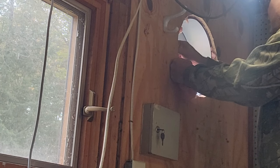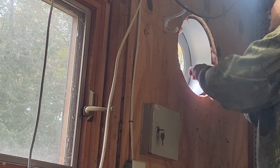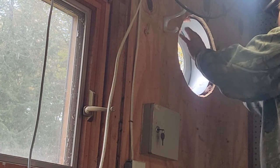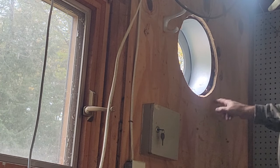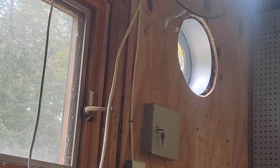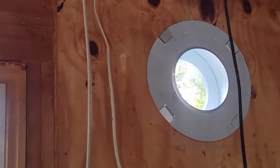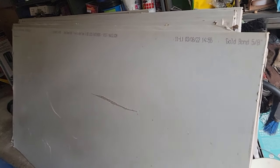The collar fits good on the inside — it looks great. I'm not going to fasten it yet because I want to go ahead and put a sheet of drywall up here to seal the wall, then slip the collar on. I went out in the shed and got drywall from the pack we bought — there are about seven full sheets and a purple board. These are five-eighths. I don't need five-eighths in the entire garage — it's only required on the house wall. By the stove I'm going to use the five-eighths.